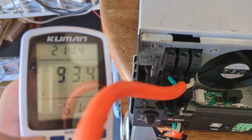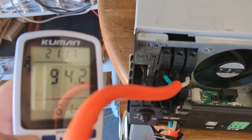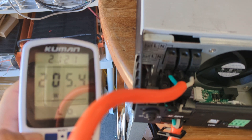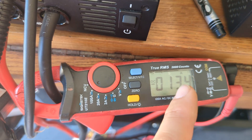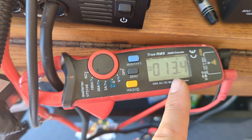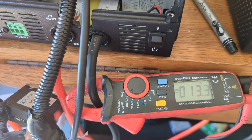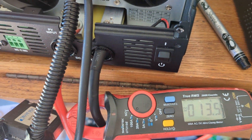It's 93 volts going into the system — that's unacceptably low — at 2 amps. So 207 watts, and we see here that we're actually only reading 97 volts as well. The input current is only giving us 13 amps, and that's purely because our incoming voltage is so low that it's screwing up the entire system and not giving us the right values.